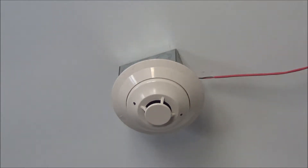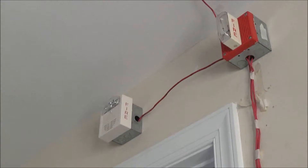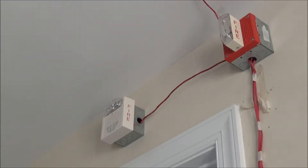Let's go ahead and move on to the notification devices. If the detector is on the ceiling then both notification devices must be on the wall — and they are. The two notification devices today were chosen by Utah Alarms; please go subscribe to his channel. On the right we have the Wheelock MT4-24 LSM VFR fixed 1575 candela strobe, doing California code controlled by the panel. And the Wheelock AS-24-110 WFW on the left is doing Code 3 by means of Wheelock Sync and is able to do audible silence.